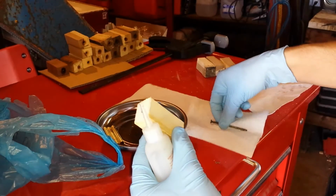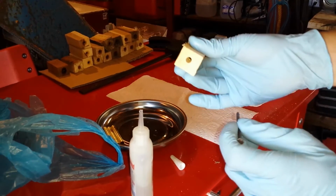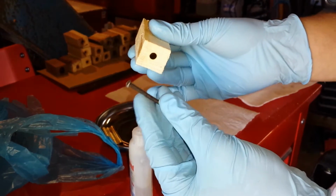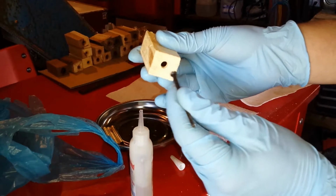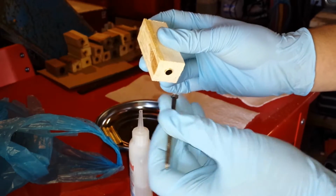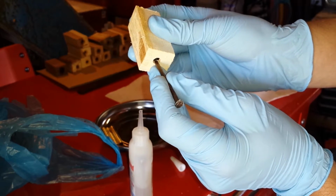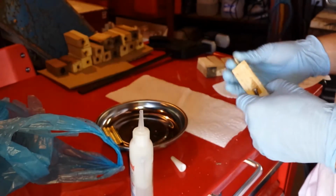And then always have a nail ready to push this tube. See, your finger can only get it flat once there's glue in there. So I take the head of a nail that I've either sanded down a little, and I can just push that in just a little as far as I want, but obviously making sure that I'm not coming out the other side. Or you can use the tip of a nail and run the tip of the nail down the inside of the piece of wood there, and you can actually just push the pen tube in.